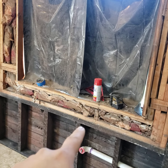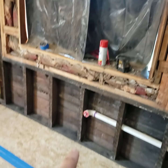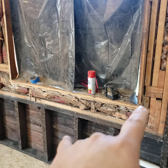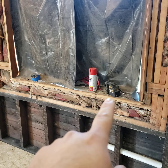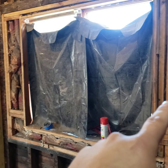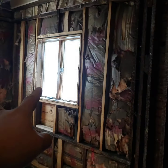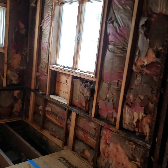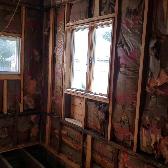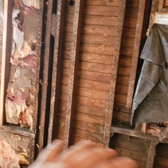This window is too low — it's about 35 inches. You need at least 37 inches from the subfloor up, and that won't include window trim, so you've got to add at least another 3 inches. I'm gonna replace this window with a shorter, smaller one. This other window is getting eliminated 100%, and that one's getting eliminated too. That one's gonna get updated. I didn't update or eliminate any windows upstairs — I made it work up there.